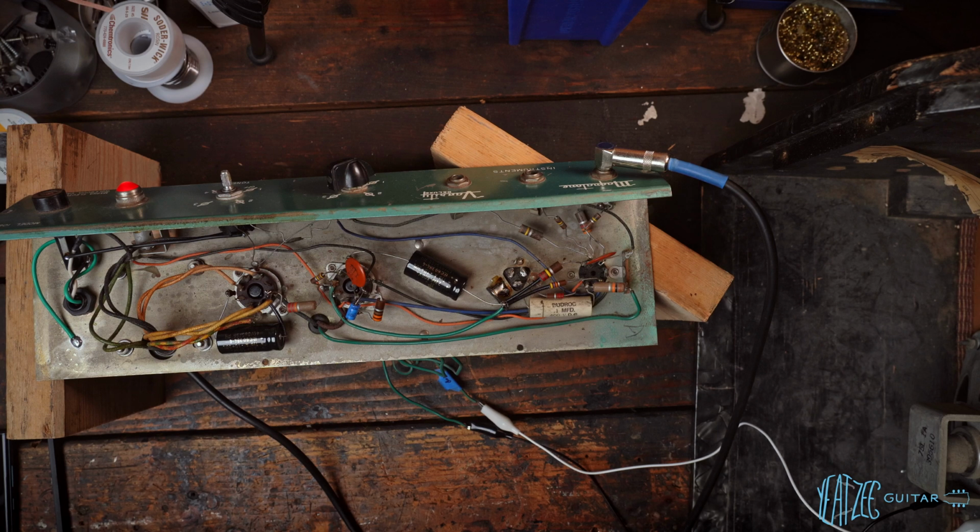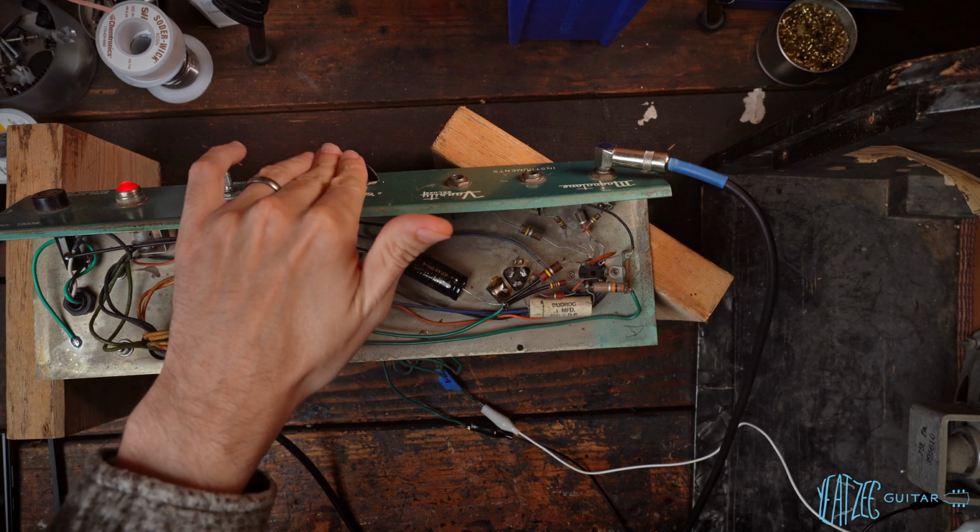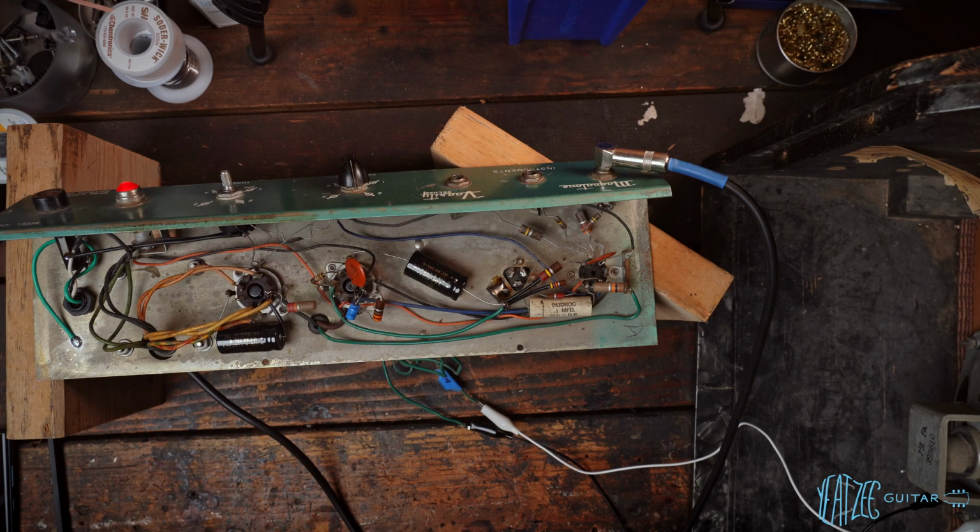You can look at it. So to go from 120% down to 100%, which is not a huge jump, it would take quite a big leap in the resistor value, which would have effects on the plate voltage and change the tone in the end. So I think we're good to leave. It's got an old 6V6 in it, not showing any signs of issues with me so far. So yeah, that's kind of where we're at.